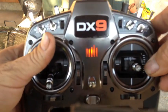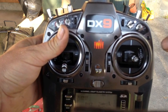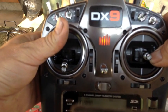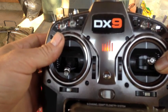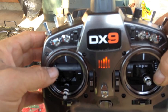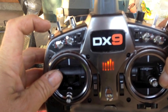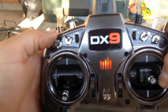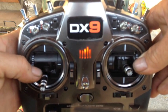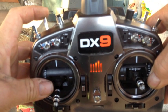All right. Now, I see everybody here cutting grass and they built themselves a mower and it's shaky, it's jerky. These motors are strong, but it seems like no one knows how to set up the expo rates. So, this switch and this switch are my expo rates. Forward and reverse have three separate settings: mid rates, manual mode. Same for the steering: high rates, mid-rate, normal mode. Helps a lot. It's not jerky now.